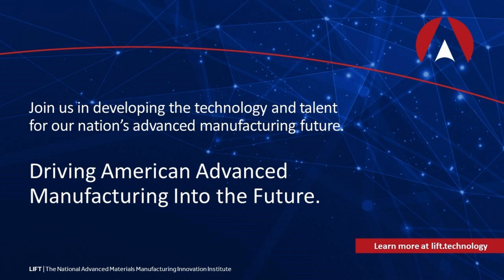They usually have a window that's laser safe, so people don't get accidentally lasered. You may have to put in some kind of special window, one that's transparent for infrared. I've had situations where I went out for tests and it would work with the existing window, but that's not always guaranteed. It can be tricky, but laser powder bed fusion, it would typically be outside, and then it really depends.